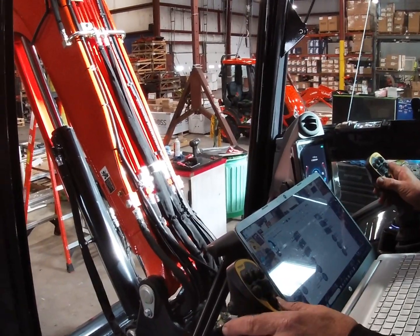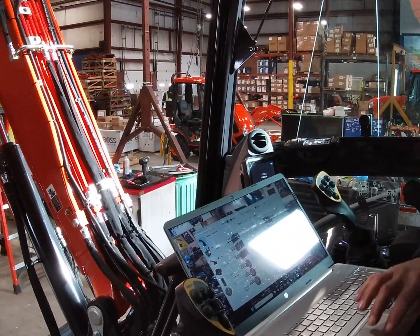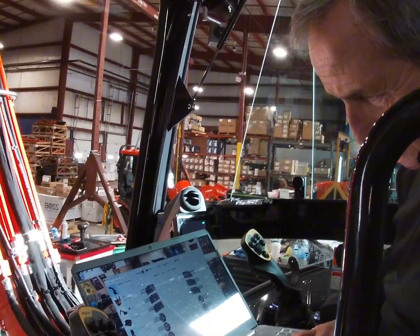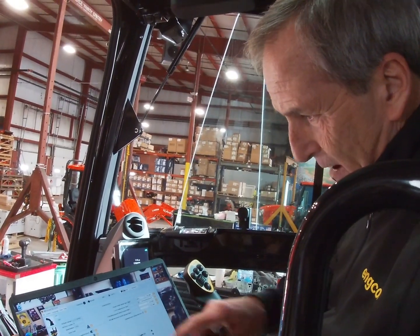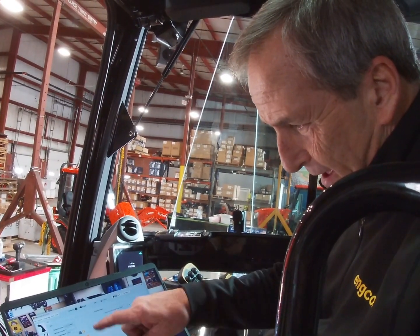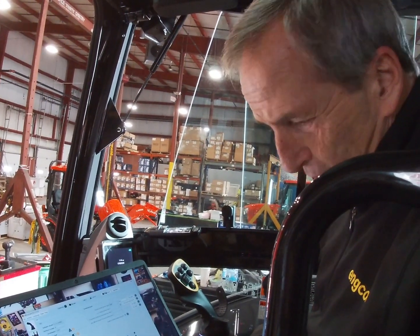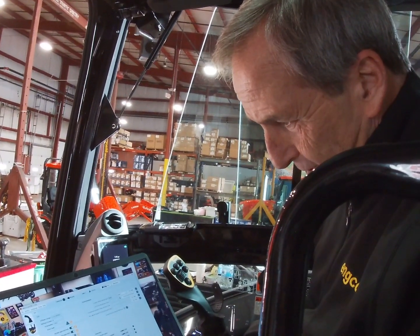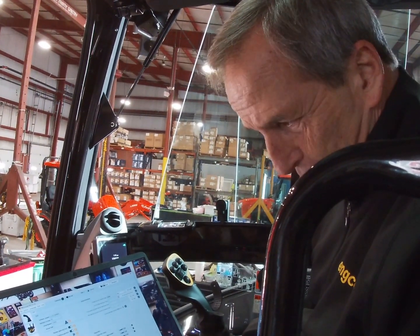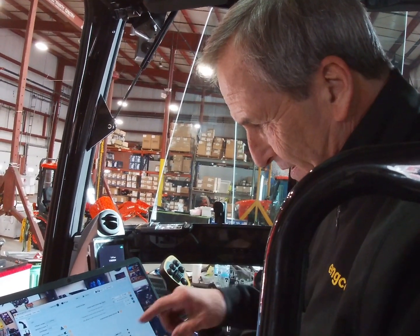So, what we should do now, before we go to the wizard, let's do the ground pressure sensor. Let's go to the QSC page. Tap on the QPM. Now, all these will light up, the ones that I already have enabled. What we're going to do now is turn on the ground pressure sensor. Let's go right down to that little thing, like your watch cell phone. Just click on it, boom, and turn the ground pressure sensor on. Go to save. That's going to light this up.